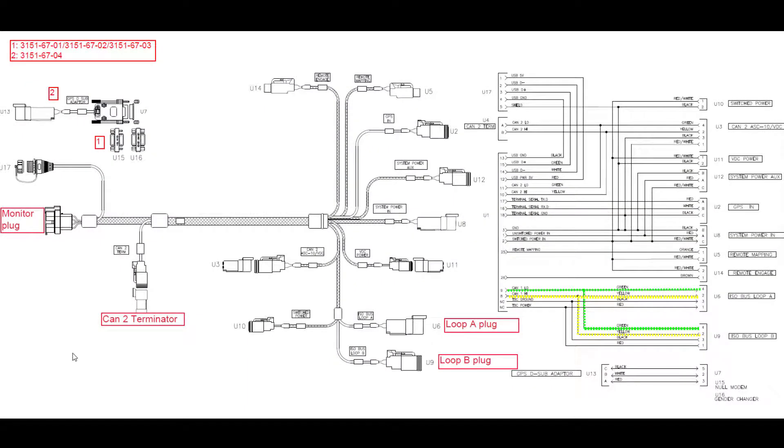We are going to follow the CAN signal through the Apollo system the way it's used on the Virgo tank. We're going to start at the front at the monitor plug. The monitor plug is here and is also U1 on the drawing. There are two sets of yellow and green lines coming out. We're going to be focusing on CAN 1. The other set is CAN 2 — it goes out through the harness, turns around and comes back, and it's terminated at CAN 2. So we only need to focus on CAN 1.